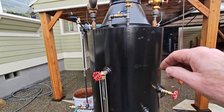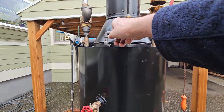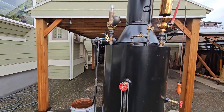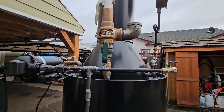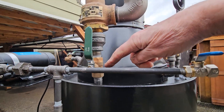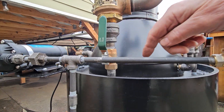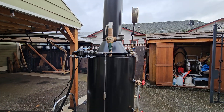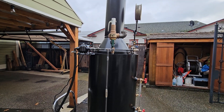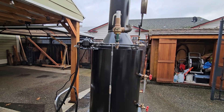When I put new wood in, if I have steam up, I run that blower. This pop-off valve is set at a hundred — it hasn't gone off yet, but it will. I'm testing it with this valve, so if it works good I'll remove this valve. I just use that as a way of shutting it off and putting another valve on if I have one.